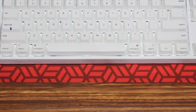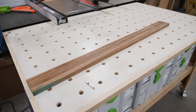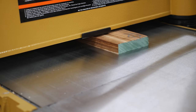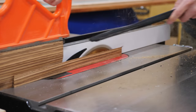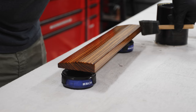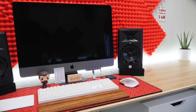The one thing about this keyboard is it's kind of tall, so I ended up needing to build a keyboard wrist rest for it. I had this piece of zebrawood that I've had laying around for three or four years just waiting for that really special project, and this was kind of perfect. It was the right width, so I cut off a section, flattened it on the jointer and planer, cut an angle on the front edge on the table saw so my wrist could rest comfortably, sanded it, and applied a couple coats of simple finish. It turned out great — it's really pretty, super comfortable on my wrist, with a nice matte finish that fits my desk really nicely.